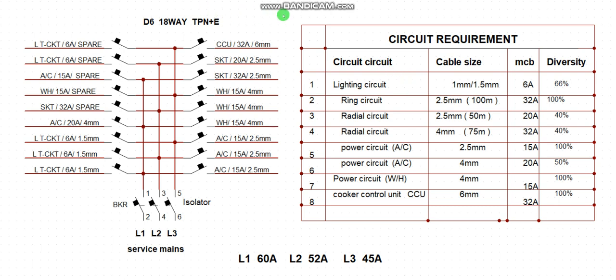The lifespan and safety of electricity at home rely on the arrangement of your distribution board. If your distribution board is designed such that none of the outgoing breakers trip from time to time, but you discover that some sockets and appliances are going bad and burning, when the excessive heat that makes them go bad was supposed to make the distribution board respond, that means your design and your installation is failing.